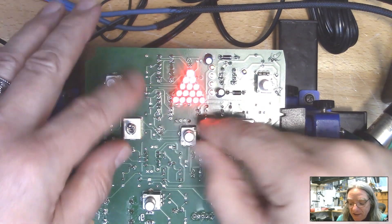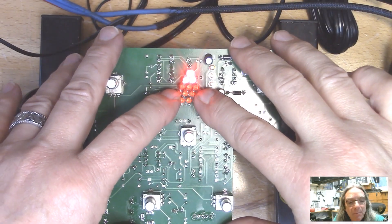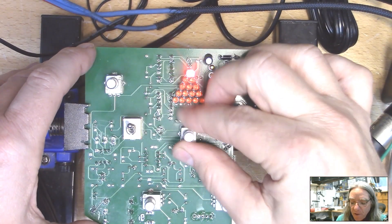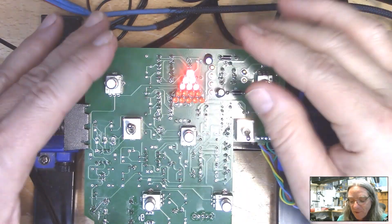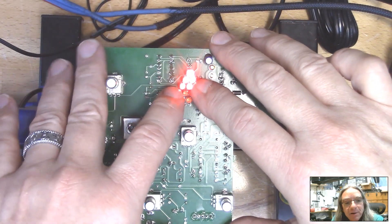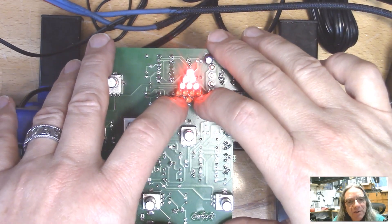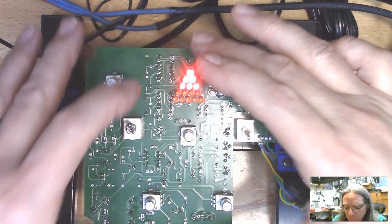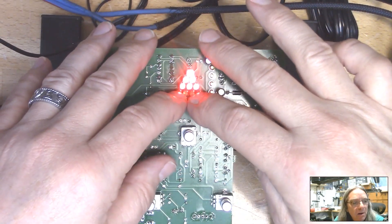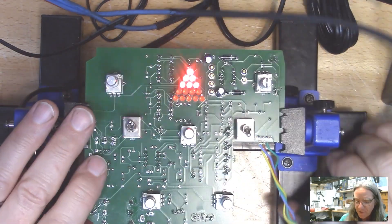So I know signal is getting to this potentiometer, meaning I'm getting signal at the output of the compression amplifier, because it comes out of the compression amplifier and then goes to the sidechain. This is somewhat like an audio meter — equipment like the Hardy preamps have meters on them, and if you have a solo on a console it tells you there's signal at that part of the chain. Anything like this that saves you from poking around is definitely worth doing. So this tells me that up to where it goes into the output level control, we have signal.